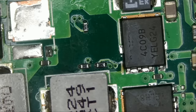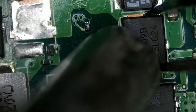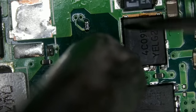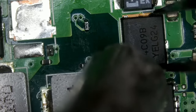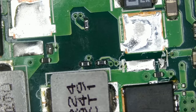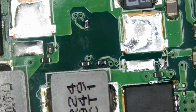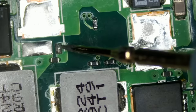Let's remove this one as well. It could be that one of those MOSFETs made the other fail — very possible. We're going to desolder this MOSFET and then measure more MOSFETs on the motherboard. We're not going to use any of those removed MOSFETs again — we're going to replace them just in case one of them is causing issues. Measure: no short. Measure: no short.